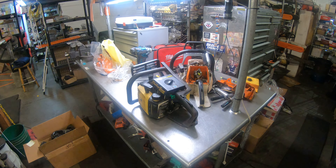Hey everyone, work at West Coast Muscle Saws. Sorry for the clutter on the bench. Backed up here this last week on chainsaws. That one in the back there is a 64 that I'm going to replace the main case gasket. We've got some seepage from the oil reservoir into the crankcase. Going to fix that.